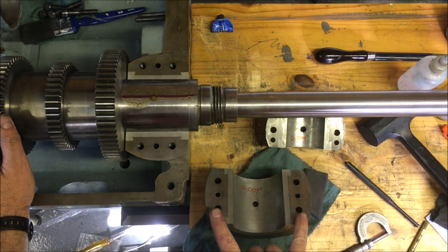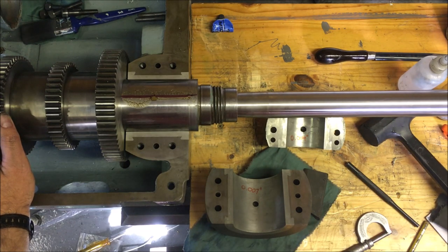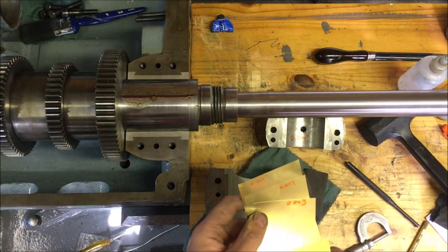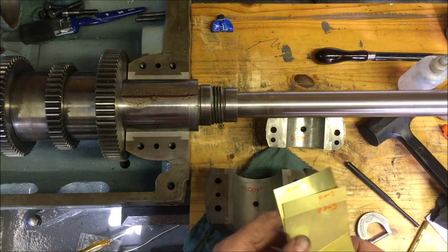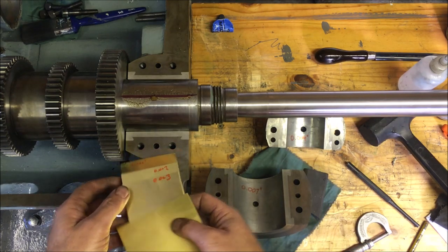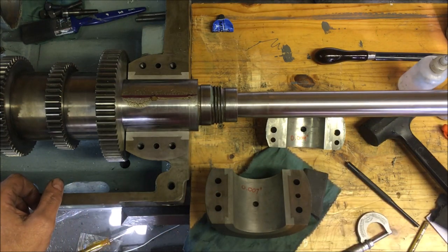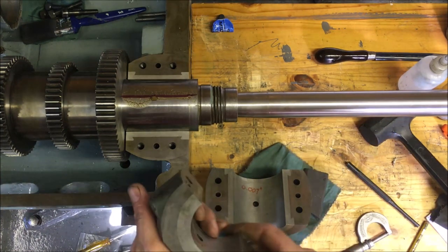Then I could stick in either a 1 thou, 2 thou, or 3 thou, as much as I like, basically, bit of shim stock. I've got some brass shim, which is just what I've got. I've got 1 thou, 2 thou, 3 thou, and 5 thou, and they mic up bob on, so I think there's just about enough to get out what I want, and I've ordered a couple of extra packs for the sake of it. And all I've done in the meantime is basically deburred the sides,